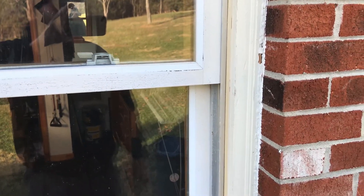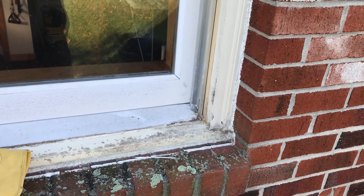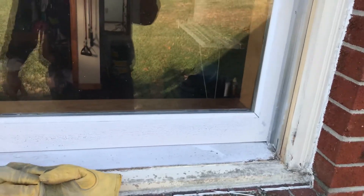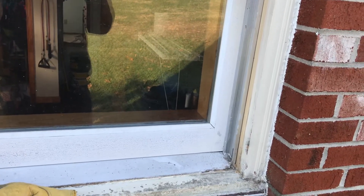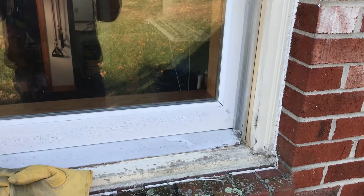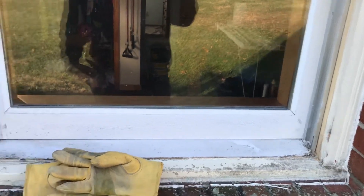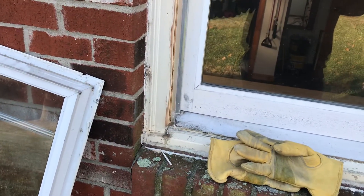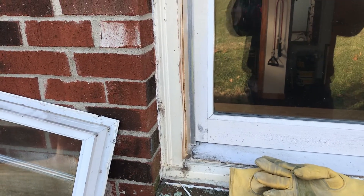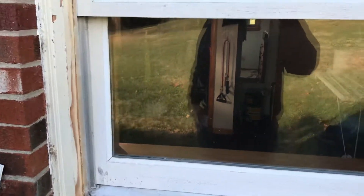Glass does not bend, so you have to make sure that all that debris and the area is clear before you try to slide the window out. Have your safety glasses on when you pop these windows out, because the parts connected to the track are spring-loaded and they'll go flying at you or towards someone in the room. Make sure no one's on the other side of the window when you're pulling it out. There's an art to this — it's not hard to screw the window in; what's hard is all these little details you have to know before or while you're installing the windows.